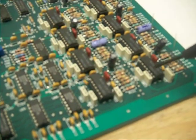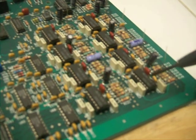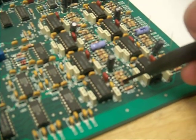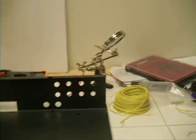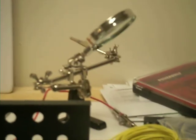Now, in order to do this, you'll have to take your resistors, cut off most of the lead on one side, and then form it into a little J-hook. Then you'll be able to get it underneath this 10K resistor leg here on the left-hand side. I use one of these little helping-hands devices to hold them in place while I solder them.